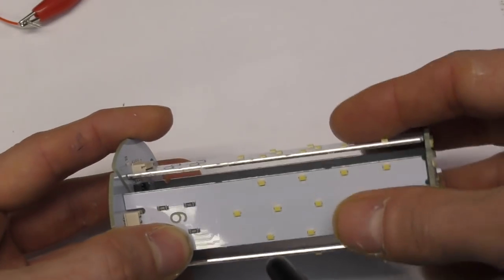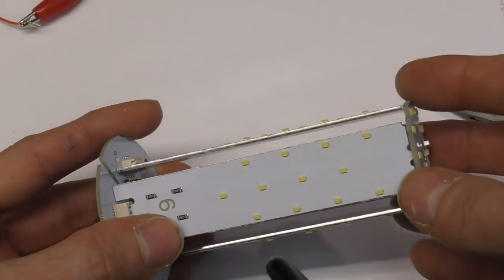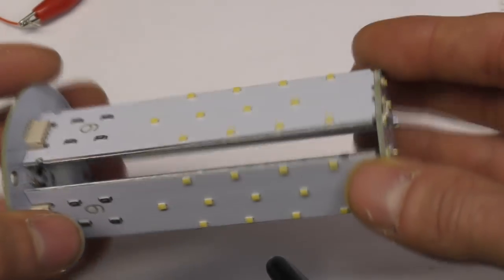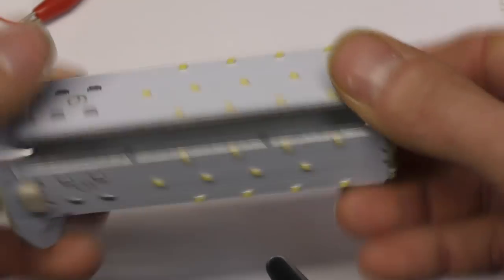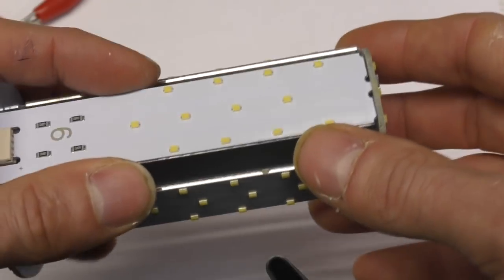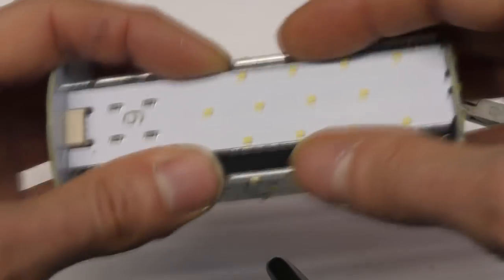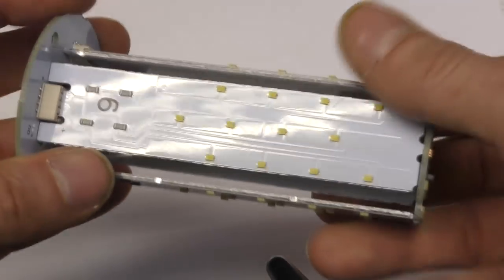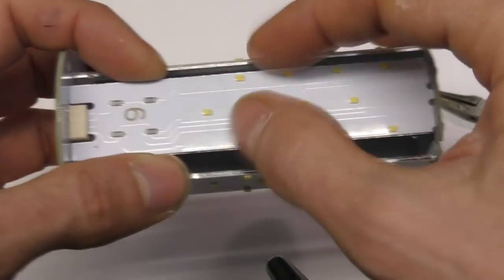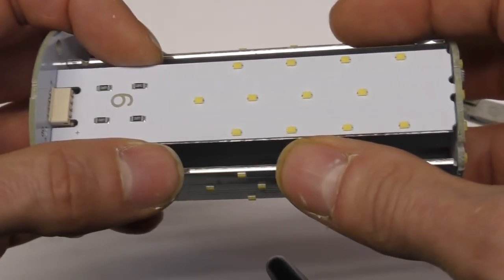Obviously inside the cube the airflow is limited. We want the cubes to be sealed so they don't get full of dust. So these are not designed to run continuously, and you can see from the video, which I'll link to, of the actual content, the idea is it's moving patterns throughout, so the duty cycle on these is fairly low, so thermally this worked out quite nicely. We use the aluminium just to spread the heat out and get it away from the individual LEDs. But the aluminium actually gave some really nice advantages for assembly.